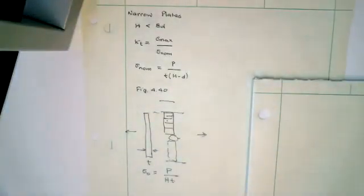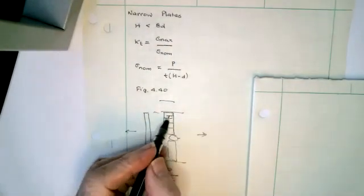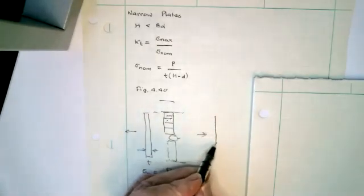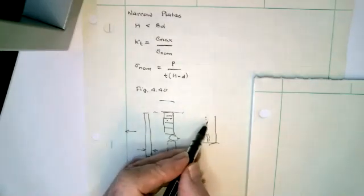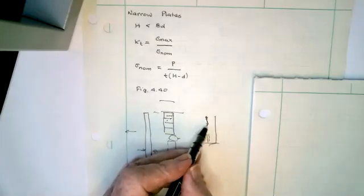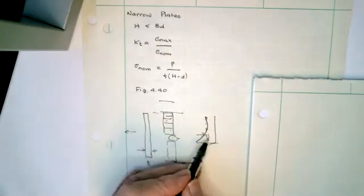Is that okay? Just to clarify, the sigma norm is above and below the hole? Yeah, that's right. It's the average stress there. Now, the actual stress there doesn't look like this. The actual stress goes like this, and locally, at the hole, it's bigger. So here's the average value. What has to happen is the average value drops down a bit. Eventually the average goes something like this, because the area under this curve has to be the same.